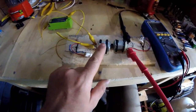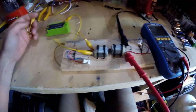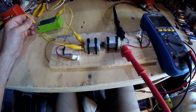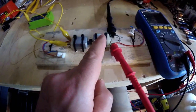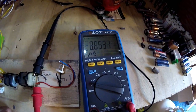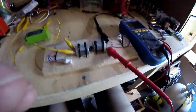I simply have one motor here connected to a couple of AA batteries, and I have a voltmeter connected to the other motor. What we're going to do is apply power and the first motor is going to spin. My batteries are not very good, but it spins. This motor is now spinning the other motor, and we have 0.65 volts coming out. So we're using 3 volts to power a motor which drives a generator in this case, to get just over half a volt output — losing almost 2.5 volts in the system.